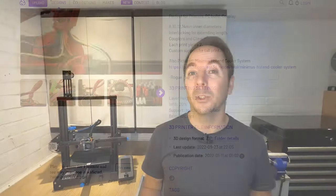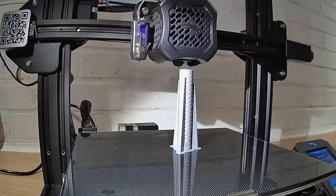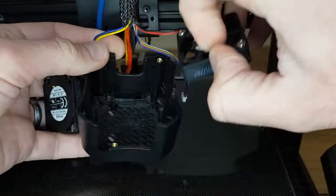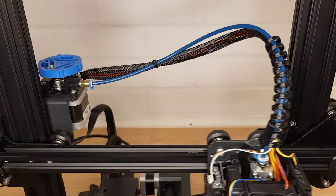If you want different sizes then for another couple of dollars Paul has all different sizes available to download. I started by printing the simplest version of the Minimus that just takes the standard fans. I printed it in PLA plus and following Paul's settings matched with standard Cura profiles, everything fitted together really well with minimal cleanup. It's very simple to unscrew the fans from the standard Ender 3 version 2 hotend cover and there's no need to mess with any wiring if you use this setup. However, if you want to add an extra fan for cooling or you want to upgrade to higher quality fans then you'll have to wire them in. If like me you want to use the armadillo wire conduit then you'll need to keep your wiring as slimline as possible.